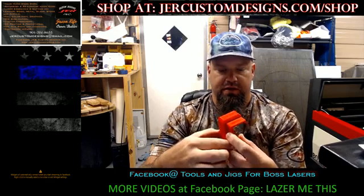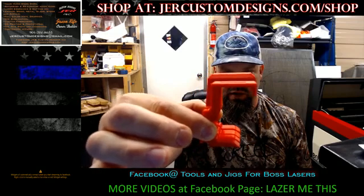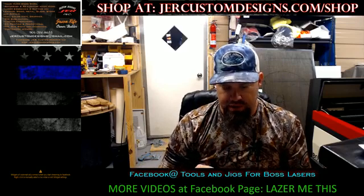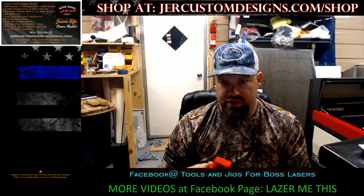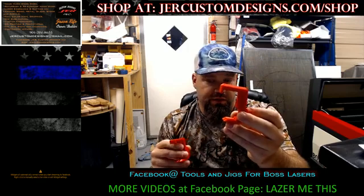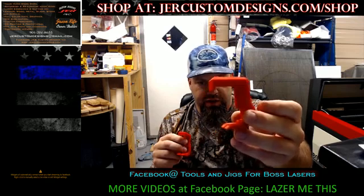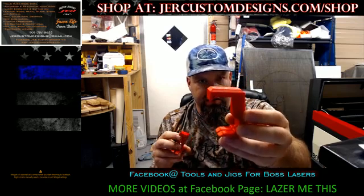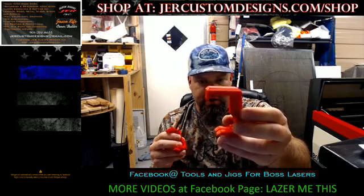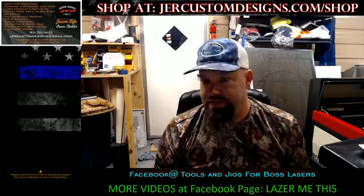The next thing you notice is the height. There's a substantial height difference in this, and the reason for this change was more to do with clearance issues. Now this was designed because I use a 2-inch lens on the bottom of the housing, and with this, it gives plenty of clearance. But if you're running a stock setup, this is, I don't know, 10 or 11 inches or millimeters, so the clearance is not there. So if you go to home and one of these is in the way, guess what? Your laser's going to hit it.